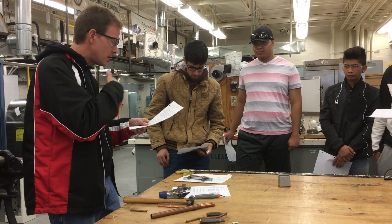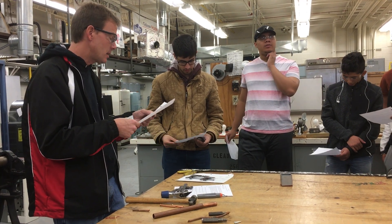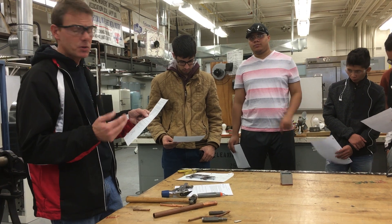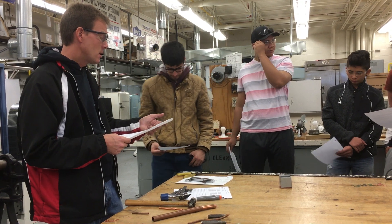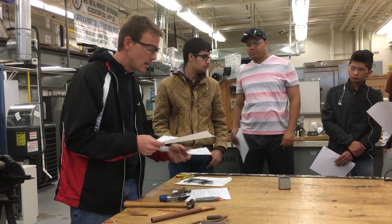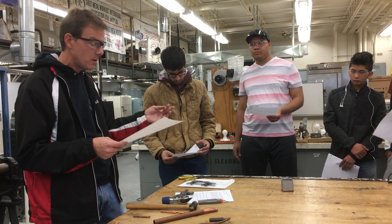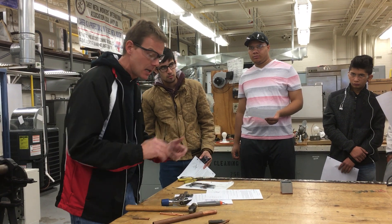You'll notice I checked frequently and kept turning so it wouldn't work to one side. Give it to the instructor — let me look at the swage when you're done on all of them. You're not going to do five-eighths tubing — I'm going to save that for the brazing stuff. The first three sizes are all you're going to use: the quarter, three-eighths, and half. Then we're going to answer five questions. I want to talk about why swaging is better than other types of connections, what the disadvantage is between a flare and a swage joint, what happens if the swaging tool is struck too hard, and the cost difference between flaring and swaging.